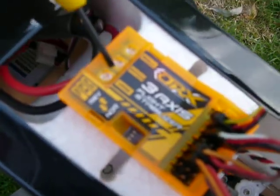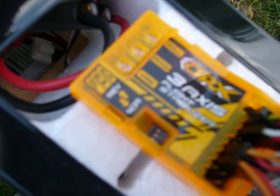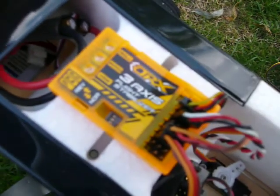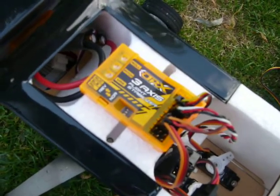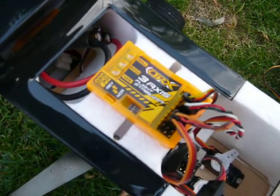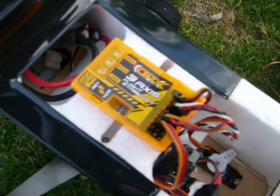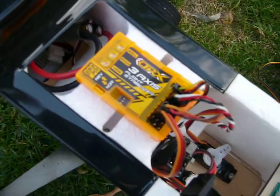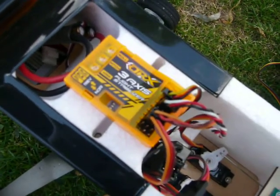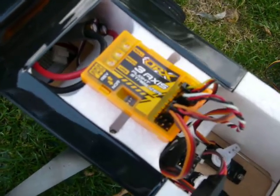We've got three little pots here. These are to adjust the gain, and that translates really as how much correctional movement you get from the norm. It's worth mentioning what the norm is — it's not straight and level or when it's on the ground. It seems to be whatever the last known position is with no controlled input. So for instance, if you're in a dive, it will soon get to know that attitude as normal, and any deviation from that will result in some correctional adjustment to the control surfaces.